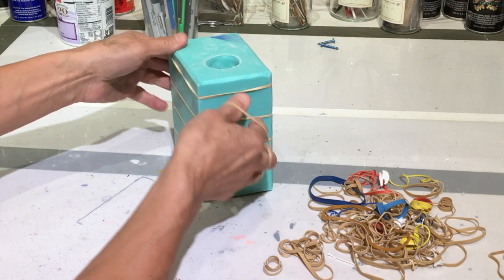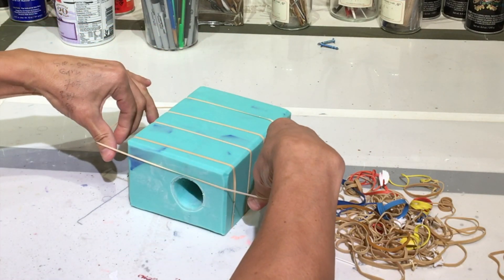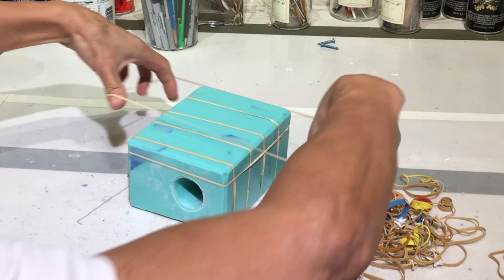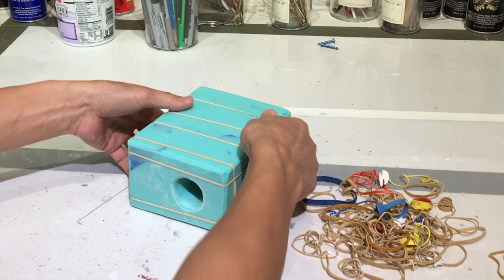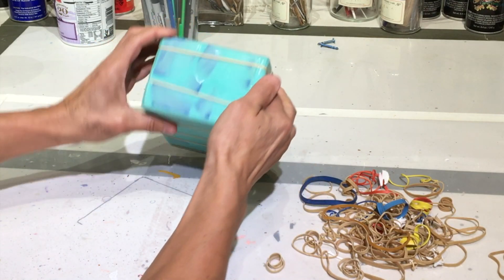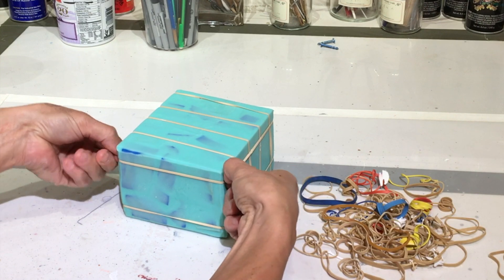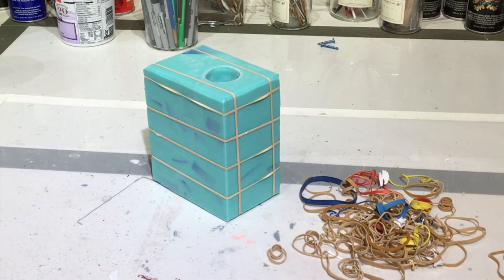You can always make adjustments after you pour one. If you pour one and it looks a little squished or deformed, maybe on the next one use fewer rubber bands. A nice thing about block molds is there's a set of three parallel faces that can all be banded, which gives you extra pressure from different directions and will also prevent your molds from distorting. Make sure you collect a big box of rubber bands so you can always pick and choose the size that you need.